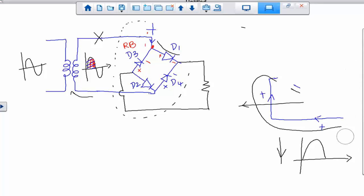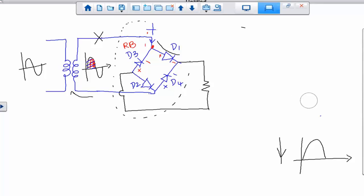So let's take a look at how we can do that negative half cycle. When we talk about negative half cycle, what will happen to the signal itself? So in the negative half cycle, the signal coming from here, correct? That's a negative. But remember that we always talk about the conventional version. When that is negative, then this side would be positive, correct? So if this is negative cycle, that means that's negative and this would be positive, right? So that's basically the negative side of it.